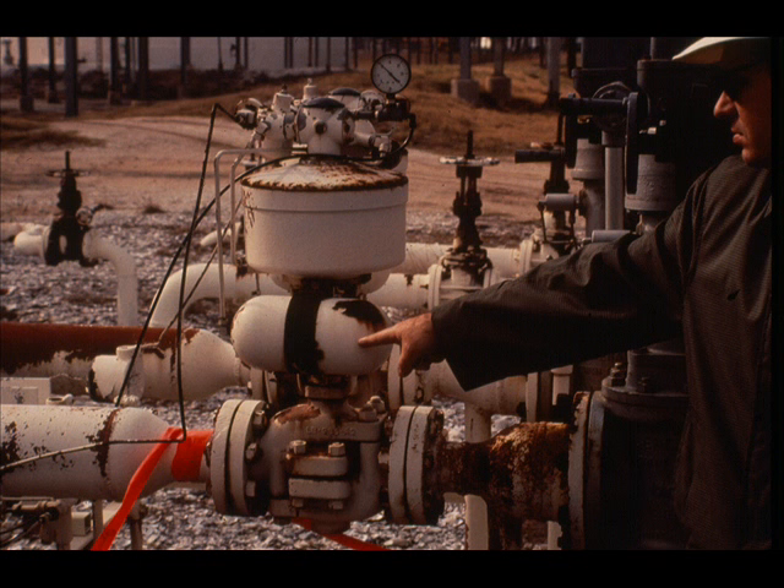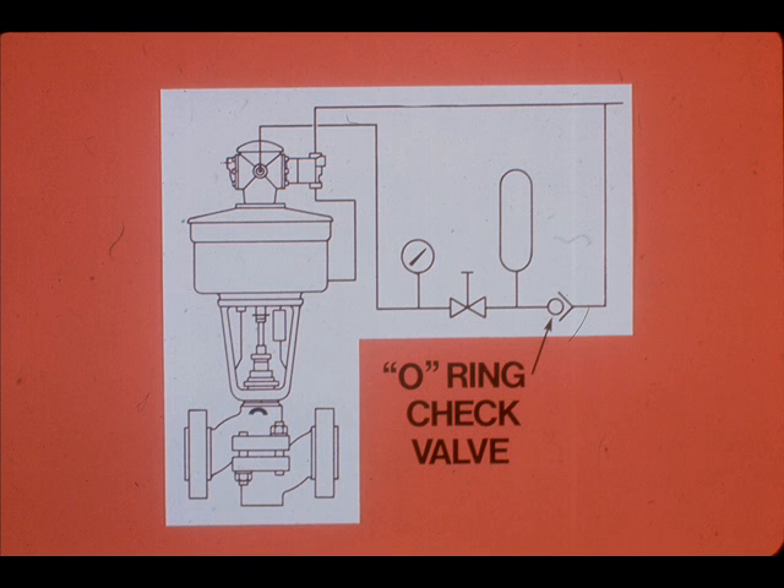KanoFlow positioners can be direct or indirect. In addition, they can be made to fail safe by the addition of a capacity tank containing a stored volume of air at supply pressure. The tank air is sealed bubble-tight by an O-ring check valve. This stored air pressure on the cushion side of the piston provides positive valve opening or closing upon air supply failure.